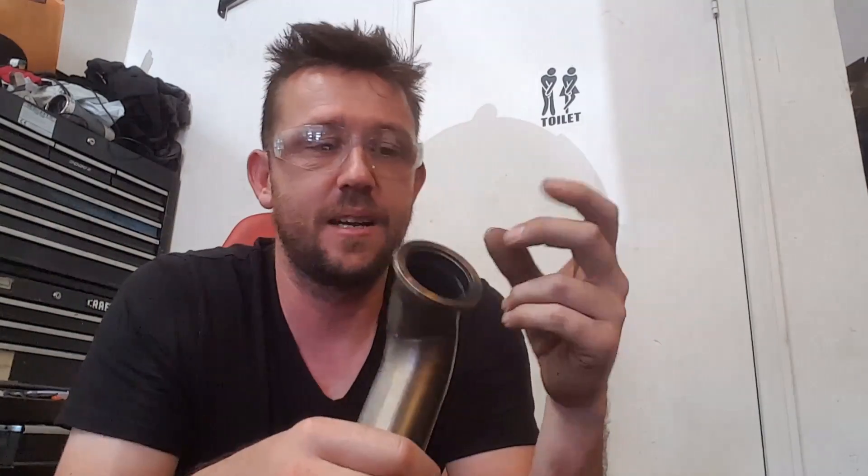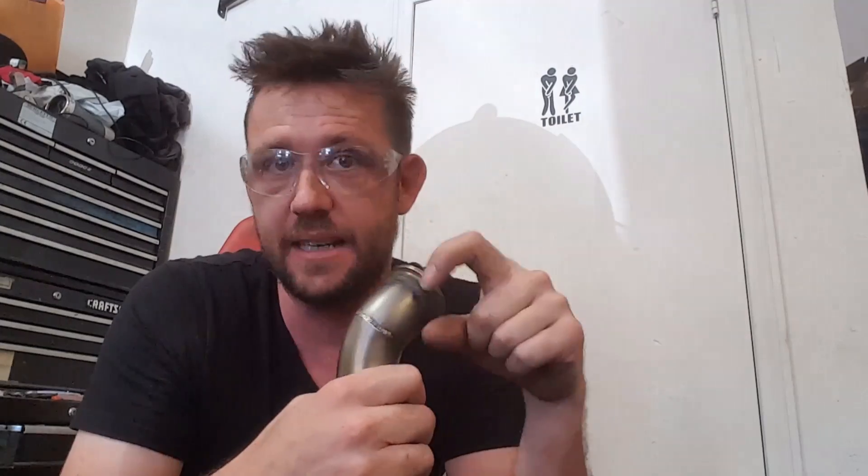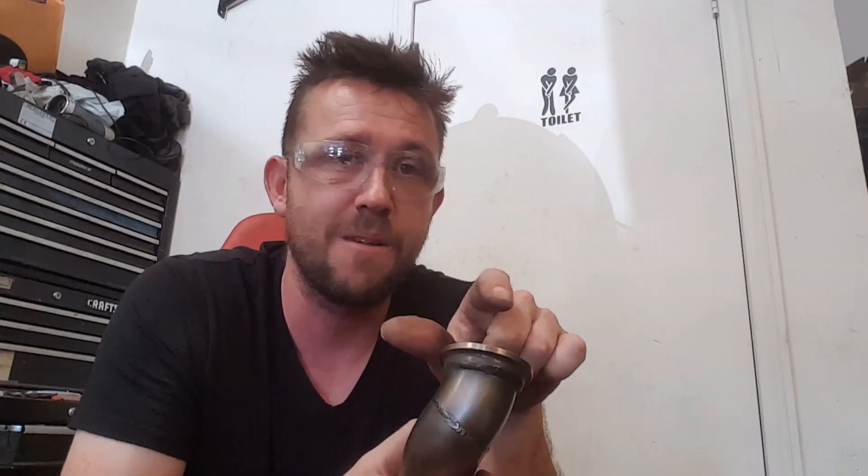So all of what's on the inside of here is what we usually call sugaring. Stainless steels — like 304 series or 300 series stainless — just about every stainless steel reacts with the atmosphere at a certain temperature, meaning when it gets hot, instead of the weld solidifying correctly — or solidifying like the outside does when it's covered under argon — the inside, when exposed to atmospheric elements like the air we breathe, reacts with the atmosphere. That means it starts sugaring up, or it turns into this nasty granular material, which a lot of people would recognize as carbide precipitation. It's basically the equivalent of a metallic sponge — filled with holes — and however far the atmosphere reacted into the actual weld itself is how much it's filled with those holes, that nastiness, and that brittle weak material.